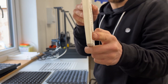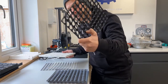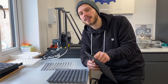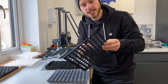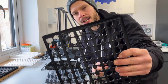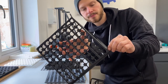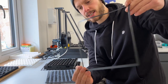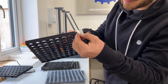That meant it wasn't the fault of the material — it was either the printer itself or the design. So I went back to black PETG and changed the build profile, making it slightly less dense inside so there weren't so many hot spots in the print. That helped, but the biggest difference was something called a brim — you print extra material around the outside edge to give a much better contact patch to the bed. This worked a treat. When the print is finished you peel off this brim, and any excess little bits can just be taken off with a blade.